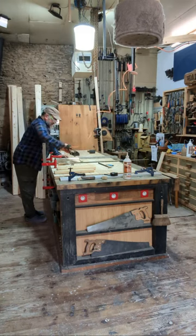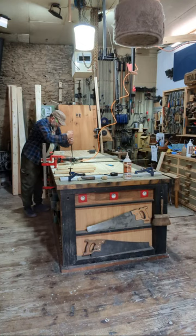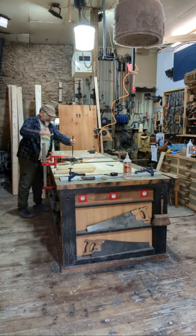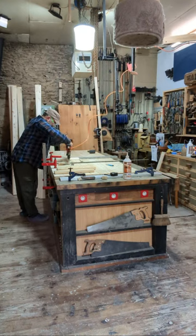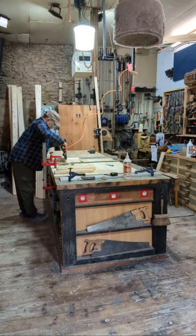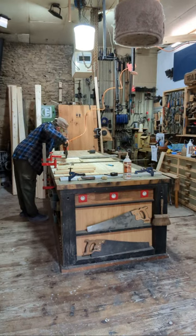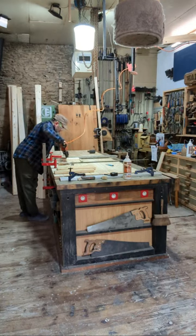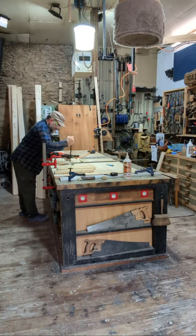It's the first one there. I then grab my little fishtail wedgie thing and chuck it in the gap. Make sure it's 1 millimetre. That's what I allow per board. Next one, and like so. Then again. Get that gap. That one's a tight one. Getting it, that's it. Not quite. There as well. There you go.